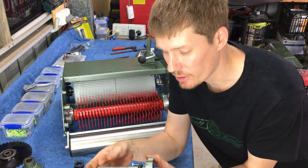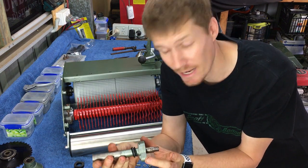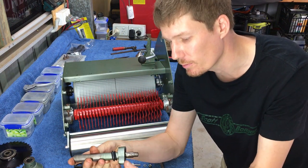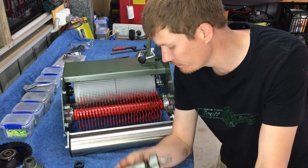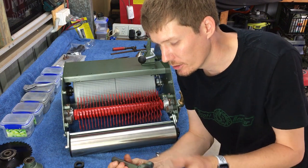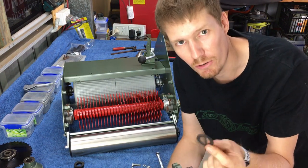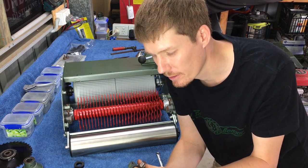Okay, so I've got the shaft pressed into the bearing. I'll install the bearing housing up on the mower. So that's just 2 bolts either side, lock nuts on the other side. Now when doing that, just make sure you don't forget to put your bearing seal on the back. So that's just the rubber washer. Slip that on.